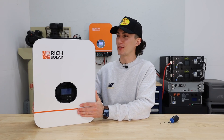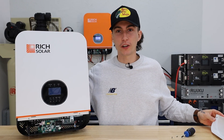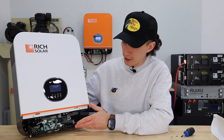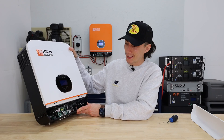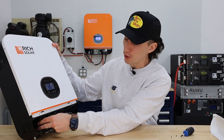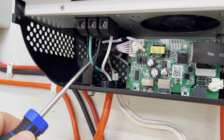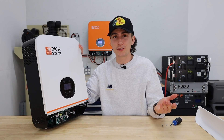There are a few things we don't love about this unit. The first is that underneath the faceplate is extremely intimidating and kind of messy. If you're new to this at all, looking underneath could be very daunting. It isn't hard to set up, but it is a little hard to access some connections in the back — like your AC out screws, which are behind two wires. You end up in an annoying situation trying to get wires into that back port. You can do it, and once you're set up you shouldn't need to unplug anything, so it's a one-time pain, but it is a pain.